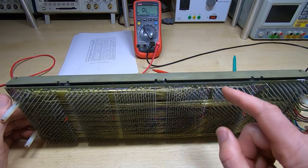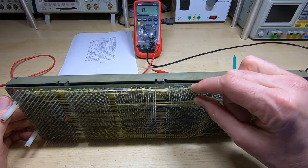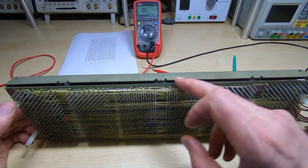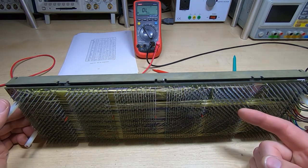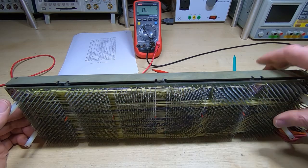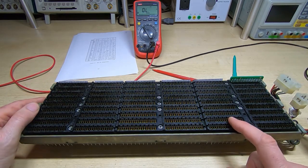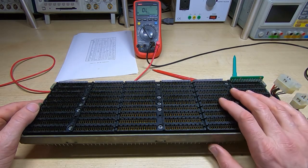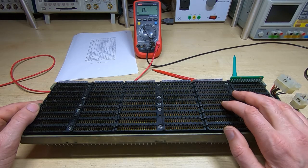So let me turn this over and we'll see what the problems are. We've got all these pins and they sit on a PCB, with a plastic sheet between the wire wrap wires and the PCB. The PCB carries some signal wires and a lot of the power that goes up and down the backplane. The best — or nicest — solution would be to just make up a replacement PCB. The problem there is sourcing connectors, as these have 'Digital Equipment Corporation' molded into them, so I'm assuming they were manufactured specifically for DEC. I don't hold much hope of finding alternatives.